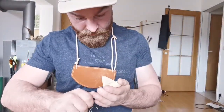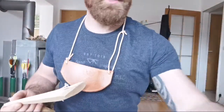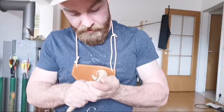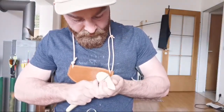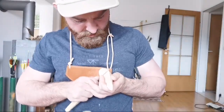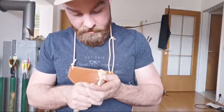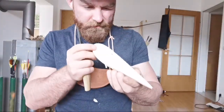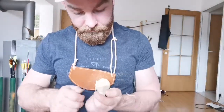I'm going to make this a little bit deeper — that crank a little bit more pronounced. On some of the other spoons this one was tangential, but this one's going to be a radial one. I have some opinions about the strength differences between radial and tangential, and also the carveability — there is a little bit of a difference. Carving tangential orientation or radial orientation — they have a difference in optics and both of them can turn out to be very attractive. It's not going to be as deep of a crank, but it's going to be enough to make it comfortable.